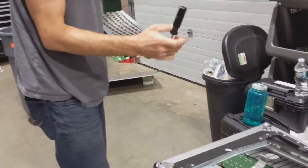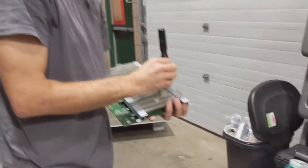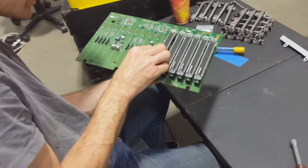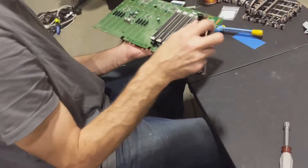You can actually open them up, clean them out — there's like a little rubber band thing in there and you just change that and you're good. But just give me new ones. The old faders are out, I'm putting the new ones on. They have this locking mechanism that makes it easy to solder them back in, and then I'll put it back together.